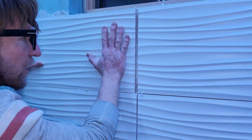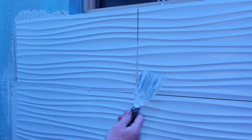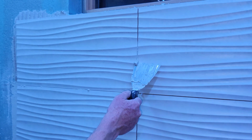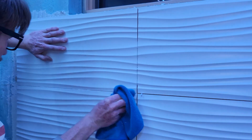And then you're gonna go down and over. Don't go too far over where you push this tile out of alignment, but see how I squeezed this grout line right here? That's looking really nice. And that's when, if you're gonna be using a margin trowel or a drywall knife, be careful on this step. Don't wanna scratch or chip your tile. But what that does is that's just less sponge work and putting your hand in thin set water. With just a heads up, your hands will get super dry and jacked up in thin set water, so do be careful about that.